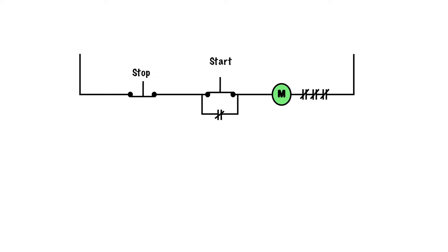This circuit is called low voltage protection. A low voltage protection circuit needs to be reset when power is returned to the circuit. So that's the difference between low voltage release and low voltage protection. Low voltage release — a two-wire circuit — will automatically start up when power returns. A low voltage protection circuit needs to be reset, so the three-wire circuit needs to have somebody go out and press that start button.